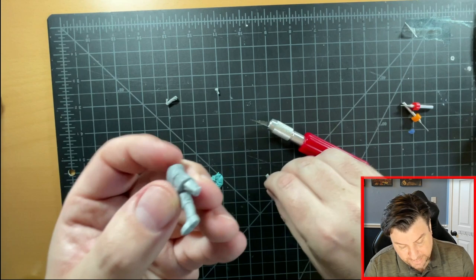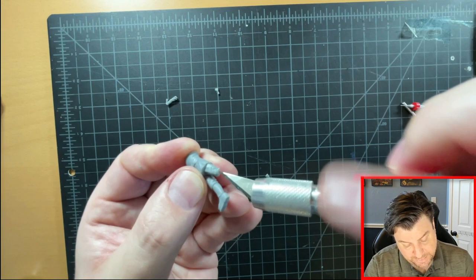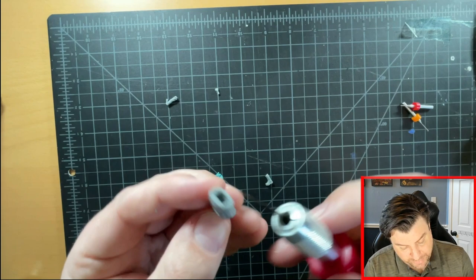Again, pilot hole. You can use a bigger drill where you've got thicker plastic. The inner plastic on these FFG models, the soft plastic ones, is actually quite easy to drill. And then we'll drill through this direction. And then we've got a little recess here. Drill the other direction as well. So basically, that's what the drilling is.